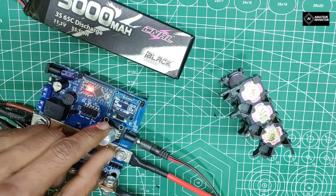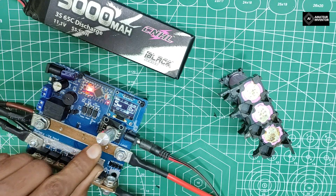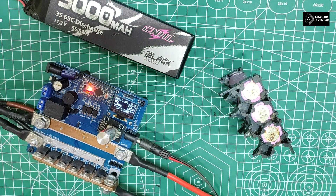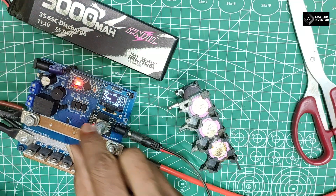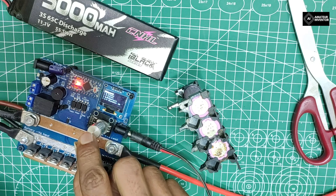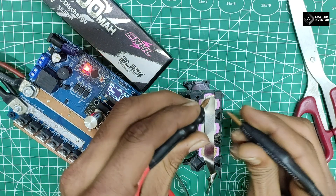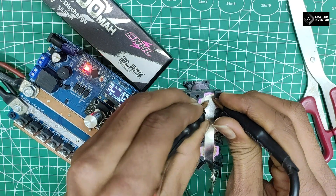Let's set the pulse to the lowest setting and always remember to save the pulse data after you change the setting. For the first weld, I will set the weld to 1P and see how it does. The strip is a 0.1mm coated nickel, so at first we will try to weld this.